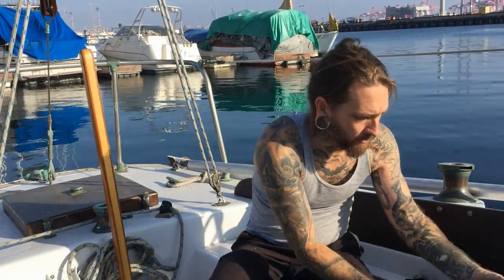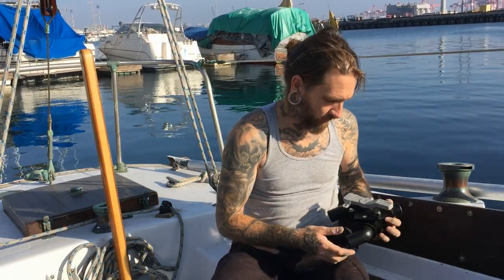I want to show you something cool I found out. The JABSCO Y-Valve comes with the one-and-a-half inch ports and then one additional one inch port, which is really handy because the JABSCO macerator pump output is one inch. So I'm going to walk you guys through how to switch these out.